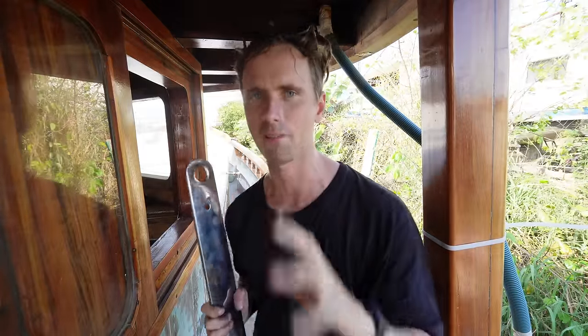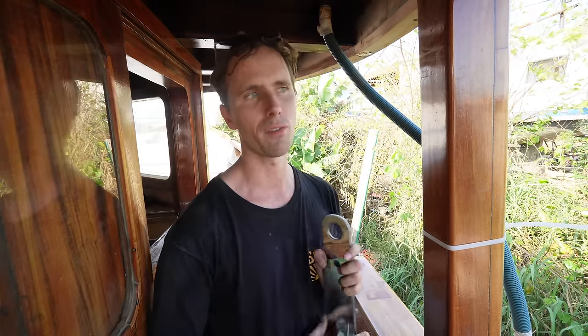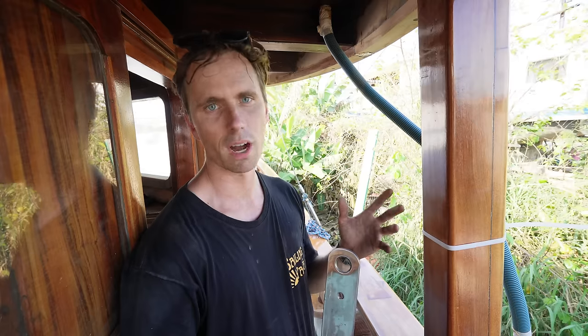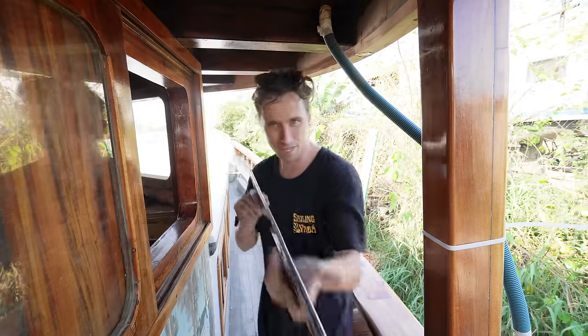One thing we realized from the start with these chain plates is we are going to have the bend in a different area, probably a bit lower. The reason for that is that the bulwark in our boat has been made slightly higher. Before it was fully closed, so you didn't have any of the open bits of the spindles, however it was a bit lower.